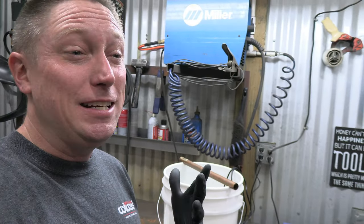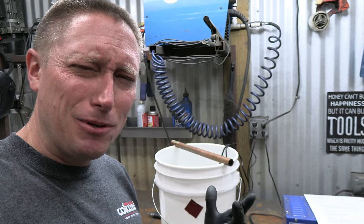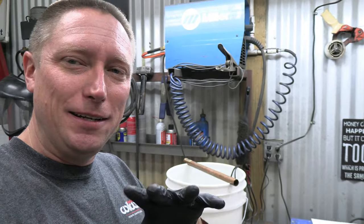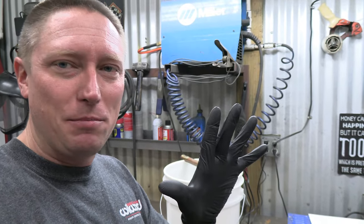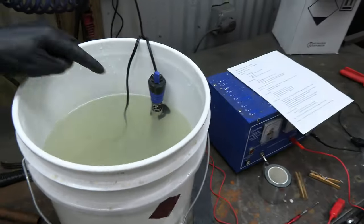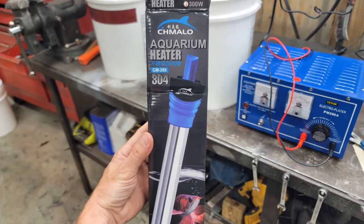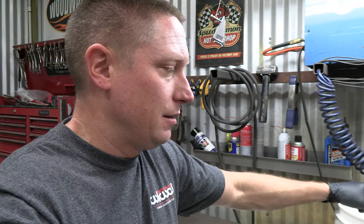It's worth mentioning that sticking a sharp metal object inside a little electric pump is probably not the safest thing in the world — so disclaimer, it's probably not safe. The second thing you're going to want in your electrolyte solution is a little aquarium heater. I like to bring mine up to about 90 to 100 degrees Fahrenheit, so make sure if you order one that it will get hot enough. I'll put a link in the description to the one I use; those things are all over eBay and Amazon.